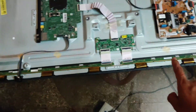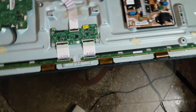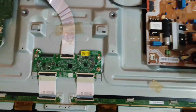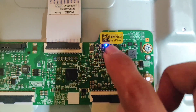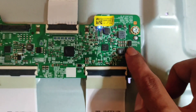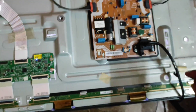To find the short in the left side or else in the right side, we have to check all the voltages by turning on the LED TV. Let's connect the cord. Friends, in this T-Con board you can observe that there are two light indicators. The first one is for 12V input supply — that is running perfectly — but the other is not glowing due to the shortage in the panel, because all the voltages are dropped due to the shortage.